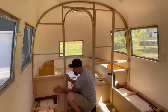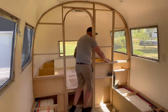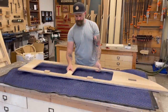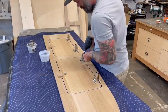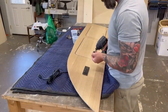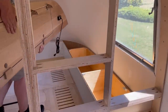Now that the face frame was installed I could slide in my panels. I purposely left a big enough gap to slide those panels in front of the face frame — it was easier to slide the panels in along the face frame rather than vice versa, so I wouldn't scratch up the freshly painted panels. After I got the two lower panels on the back side of the wall in, I stopped to install the white oak tops, because if I installed the rest of the panels first it would have been really hard to film myself installing them.